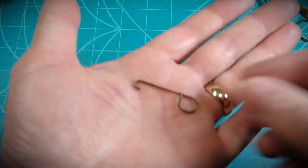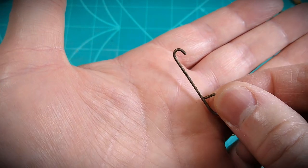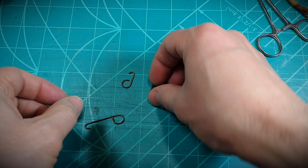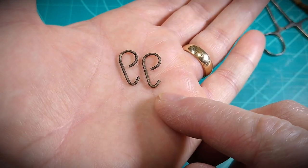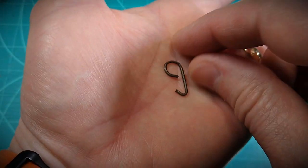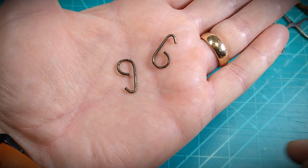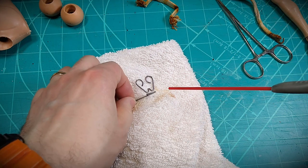So here are the metal hooks after having their bath in the distilled white vinegar. I'm going to go over these with a brass wire brush and some fine sandpaper to work out any other loose debris off the surface. After that, I'm going to saturate them with some WD-40 to temporarily, here at least, protect them from recurring oxidation until I come back to them a little bit later on this project.